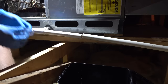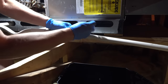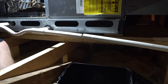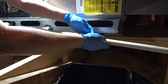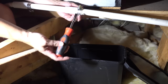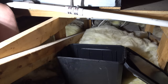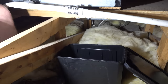You could glue this pipe back together, but there's a good chance you'll have to do this repair again. A really simple alternative is to use that piece of clear plastic tubing — stick it over one end of the pipe and slide it onto the opposite end, making a homemade coupling. This is a popular technique used by a lot of AC technicians because it allows easy access for future service. Slide it on, and I personally like to add a couple of hose clamps — cheap insurance against leaks at the joint. Tighten the clamps just enough to snug them up; this line is never under pressure, just a slow drip of water.